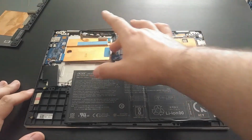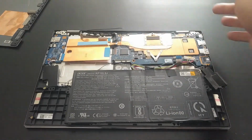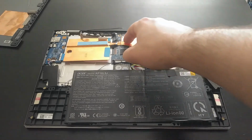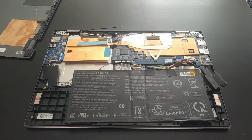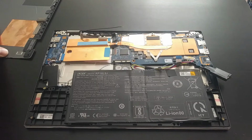And then we also have this heatsink. So again, we have the CPU, RAM, all the components on the main motherboard here, being drawn out through this copper heatsink to this copper panel, which then connects to the body of the laptop and uses passive cooling to cool the motherboard and CPU. So this is good when you have something in this sort of a form factor where the body is aluminum.